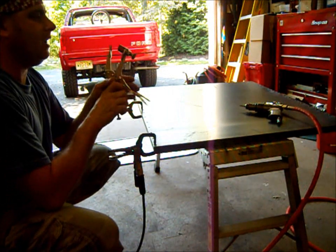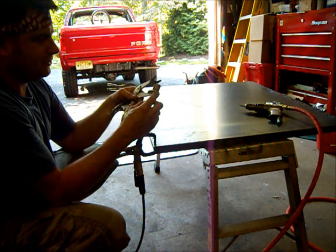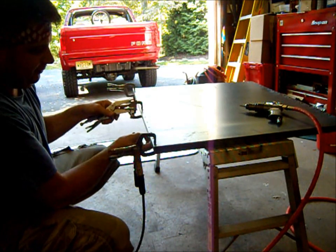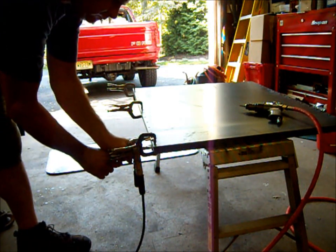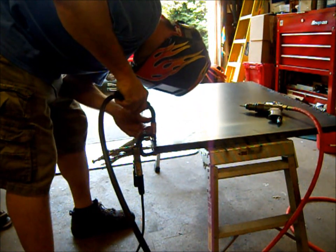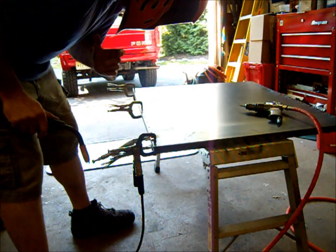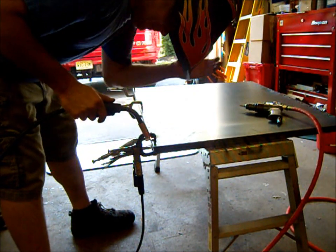The wires that came with the kit — since I have angle iron on the back, I had to adapt them a little bit. I made this up this morning: it's just a bolt, two nuts, a washer, and some copper pipe on here. So when I clamp it, it puts pressure on the back. I'll just set the tool inside the vice grip here and you have a spot weld. It works great — I don't need the clamp on this one because there's already pressure.